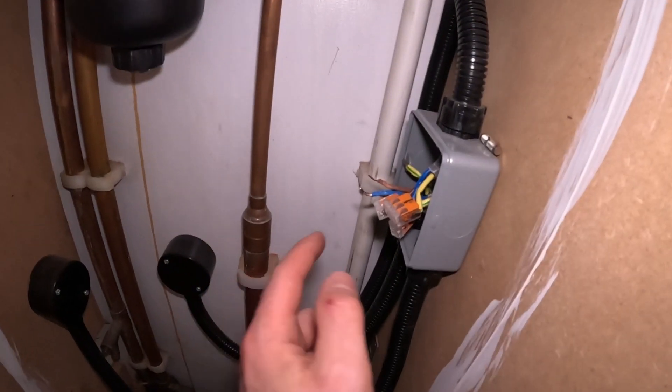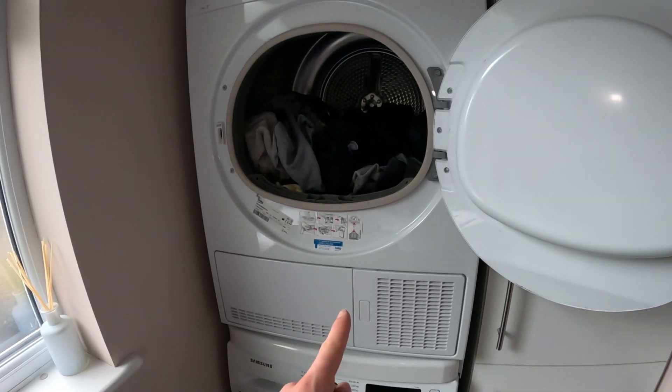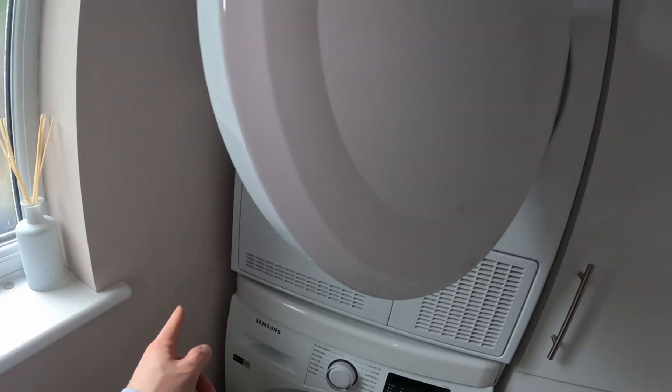So power is back on and flowing through these WAGOs. The outdoor socket is wired in on the other side, but these cables here go off to the washing machine and tumble dryer. To check it's not the appliances themselves causing the problem, I ran an extension lead from another circuit in the house that isn't tripping and plugged them both into that to see if it trips — and it doesn't. So I know it's not the appliances. It must be either the single sockets behind there — there are two single sockets that power these two — and then there's a double pole isolator switch in the back of this cupboard. I'm going to pull these out and have a look.